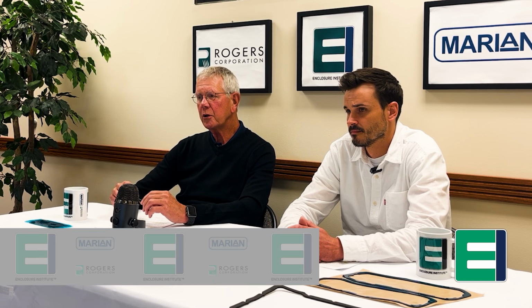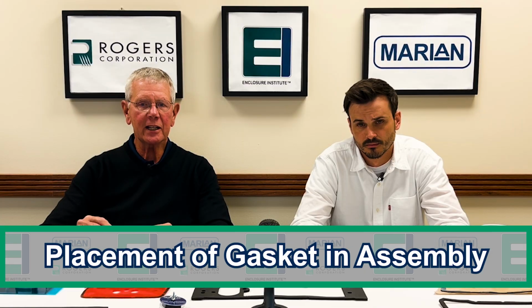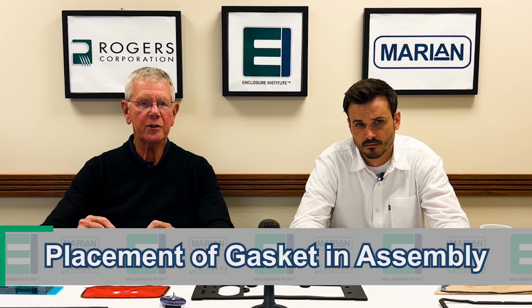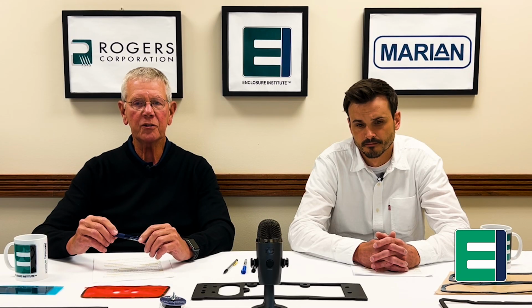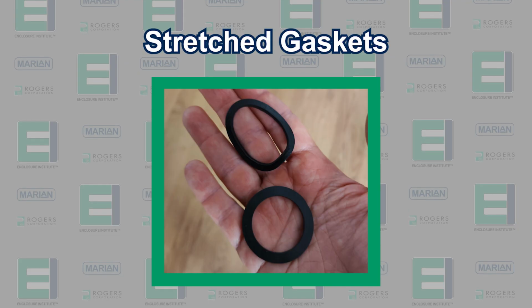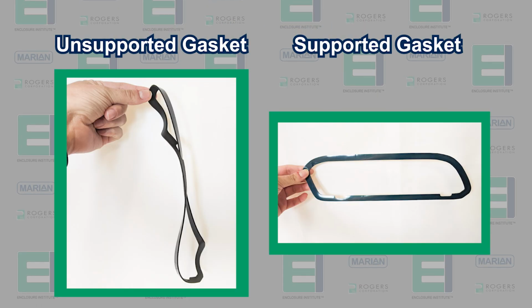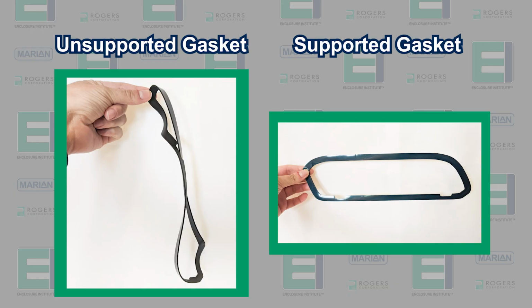On a similar note, during assembly of the enclosure, the placement of the gaskets in the assembly can be problematic. And improper handling, such as stretching, misalignment, or contact with sharp edges, can also lead to premature failure of the gasket. Care should be taken to avoid stretching the foam during installation. And if the gasket has a PSA backing, the adhesive layer can provide that stability.